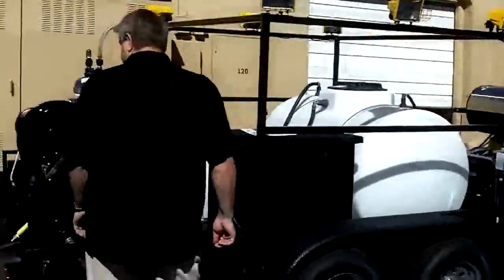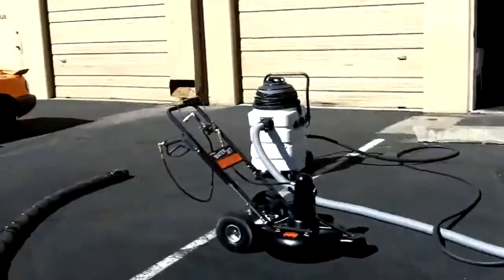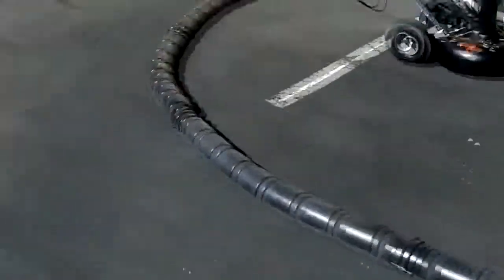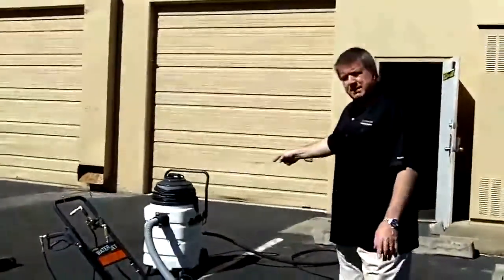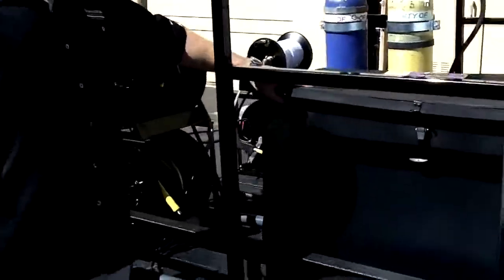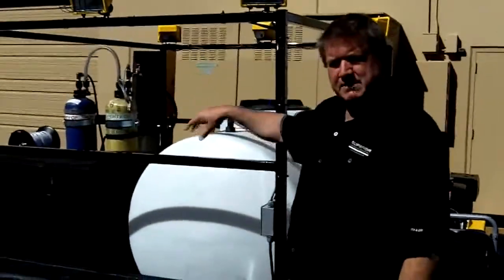Over here we've got our Vacuum Boom. In this system we're using a 202 CFM vacuum with a sump pump in it. We'll run the vacuum off the generator, place the boom out wherever we want — usually as far as we can — where we're washing, to protect the storm drain. The vacuum sucks the water up into this unit, and the sump pump pumps it out through this line into our treatment system. We've got our filtration and treatment system here — we run through some coalescing grids, some foam, and then 50, 20, and 5 micron filters, and back into the water tank. The unit does a phenomenal job of filtering the water before it gets back into the system.